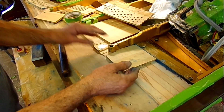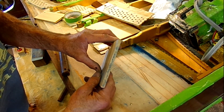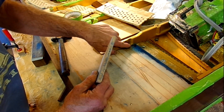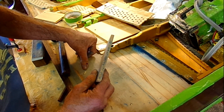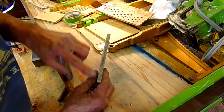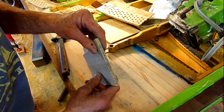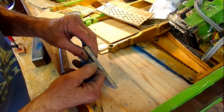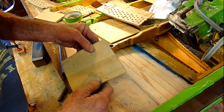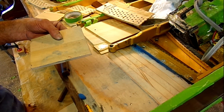That fit right there. And you can see there's a gap here in the cast iron — it doesn't touch there underneath. But we're going to do one more scraping before we glue it in. This looks pretty good. It's touching all along here. We're going to scrape these down a little bit more, and it should fit good enough to glue this in. So there we have it.